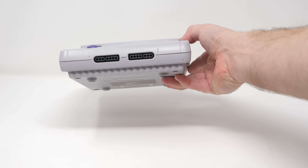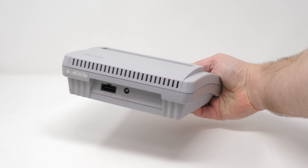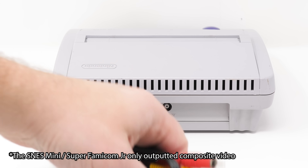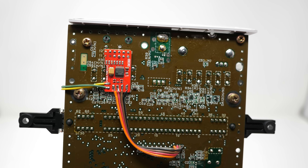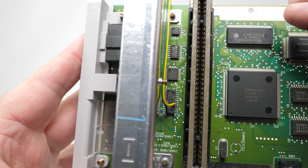One easy way to guarantee the sharper output was by purchasing an SNES Mini, as all came with the same One Chip motherboard. However, none outputted RGB by default. Enabling RGB and even S-Video was fairly easy, but it was frustrating for people who just wanted to find a nice looking SNES and start RGB gaming. So now that you have a basic idea of what to expect from SNES revisions, let's check out examples as well as some of those mods.